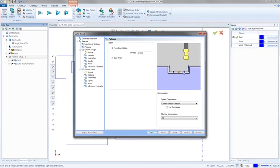So force down cutting is going to make it go from both sides of the groove. You're going to come in from the right side and cut to the center, and then come in from the left side and cut to the center. You can even give it a small overlap. You could say, I want to do a 1/16 of an inch overlap there. The basic finish is just going to start on one side, cut straight across, and come back out. I'm going to do force down.